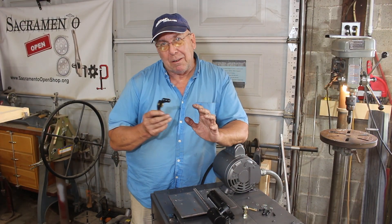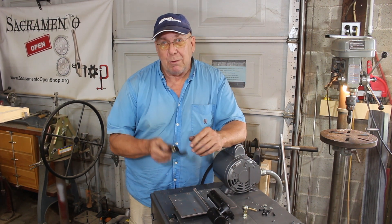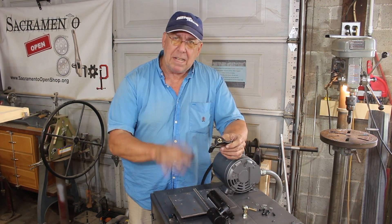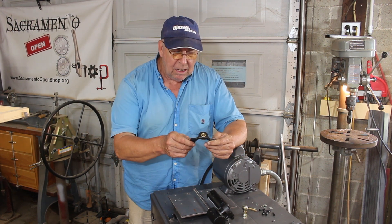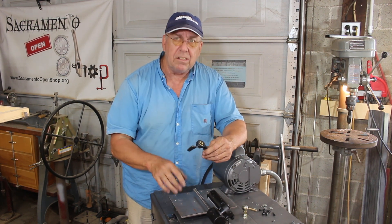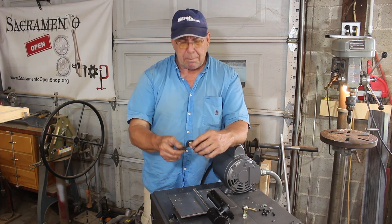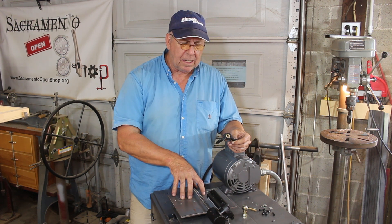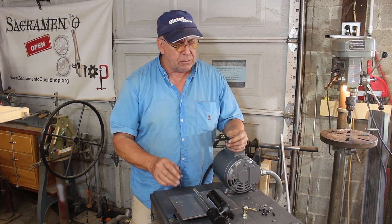I've been pretty lucky so far that I haven't had to take this apart and put it back together again, but I've reached the end of that luck. All the holes I drilled before matched up, including these on this plate. But to get the location for the captive nut for the drive screw, I'm going to have to actually bolt this together, install the drive screw, and mark the holes, then drill and tap them. I'll also have to build the fixture and clamping assembly on top of this plate — it will probably go on and come back off at least three times.